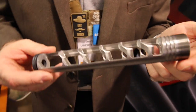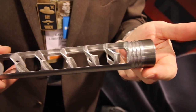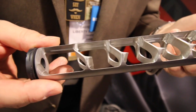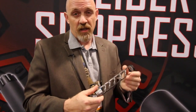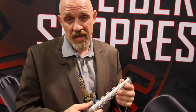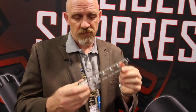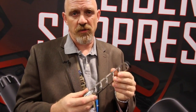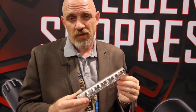What we have here is the core out of the Cosmic. As you can tell, the baffle geometry is a strong divergence from the Mystic X design. This silencer is optimized for 45 ACP and works really well in 45. We use stainless steel in the core to reduce cost — it's perfectly fine material for 45, so there's no real need to make it out of titanium and add all that manufacturing cost and expense. This keeps the suppressor really manageable in price, and allows us to cut it really thin because stainless steel is very strong. We actually have this silencer one ounce lighter than a Mystic X core.